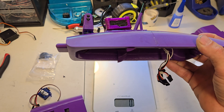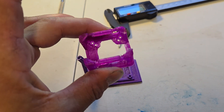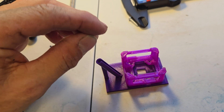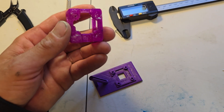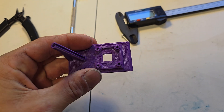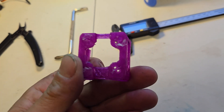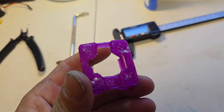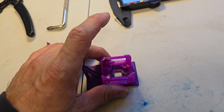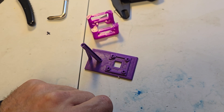The VTX piece — the VTX holder sits on here and I just use a couple of screws to secure the front two holes. I don't use all four, just two, and that works great. The mounting pattern is actually the Walksnail pattern, and it's got a dual mounting hole — one for DJI and one for Walksnail. This will be linked in the description. It sits on there, you take a couple of screws, screw it in, and it's all one piece that gets glued onto the canopy.